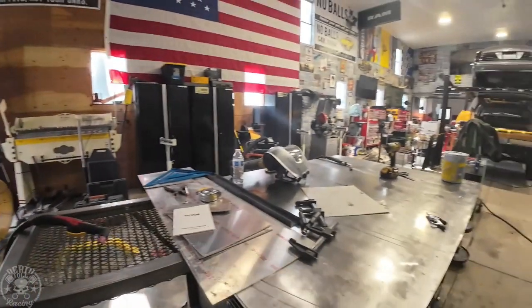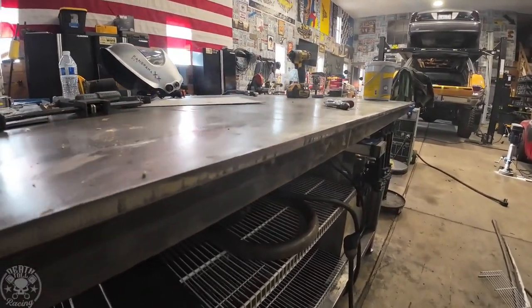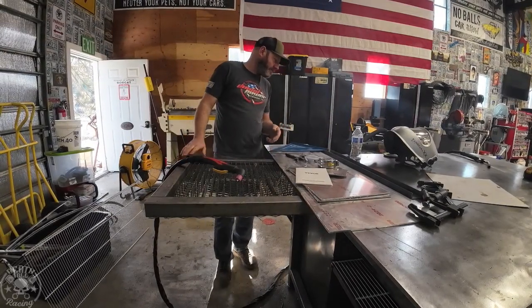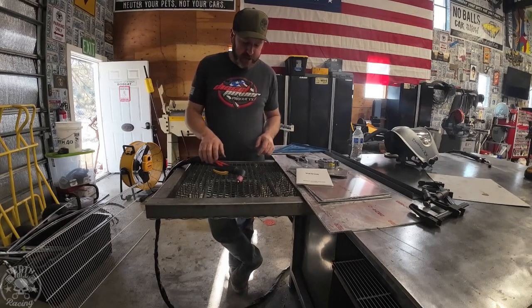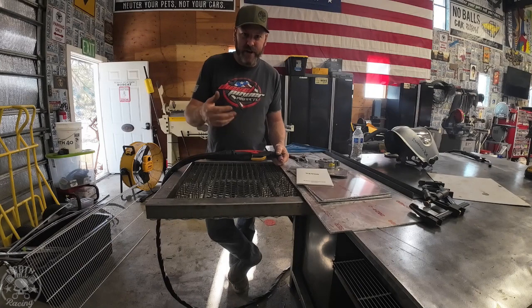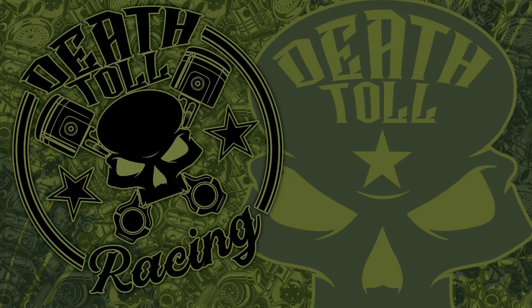The cut quality on that table turned out really good — I took one swipe with a sander and that's what it ended up looking like. That is really impressive. The plasma cutter I've been using for years is a 50-amp Lotus, non-pilot arc, and I wouldn't have been able to do that cut with it — it would have been very difficult to maintain a cut with a non-pilot arc machine. Follow those links in the description below — they'll save you 5%. I'm also going to add consumable links down there, so check those out. Like, subscribe, share it with your friends, and thanks for watching. We'll see you again real soon.